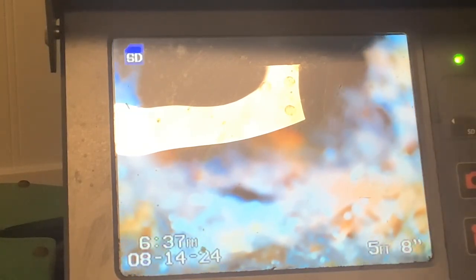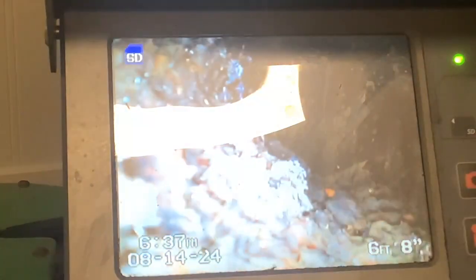But if it's like a crack... Yeah, well, he showed in that drain on the connection over there that there's a small, what he thought was a hole just inside the pipe. And like I said, that's an if with the coating, because we can do 2 inch no problem. 1.5 inches becomes very tricky, especially with how much rust scaling we're seeing already.